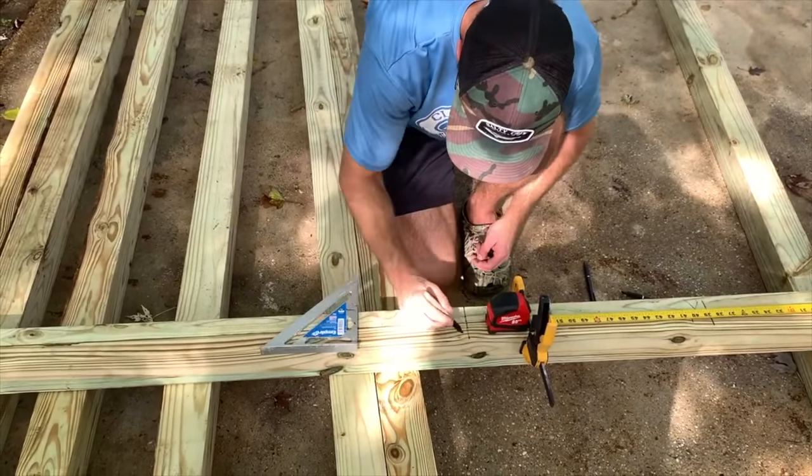Once you have it positioned in place and have the front side flush against the fascia board, you're going to nail it every 12 inches on center, attaching it securely to the sheathing and hopefully the 2x6 fascia board below. Make sure you apply nails every 12 inches on center to secure this piece of ridge flashing, and we're going to do this all the way to the end of that one piece of ridge flashing.